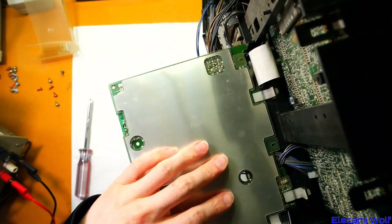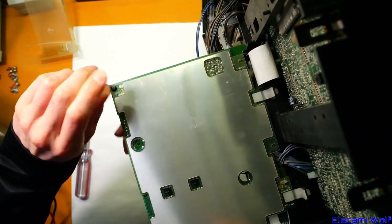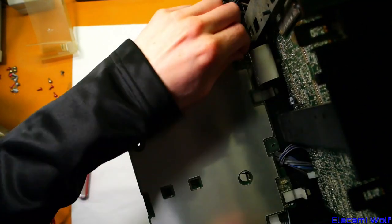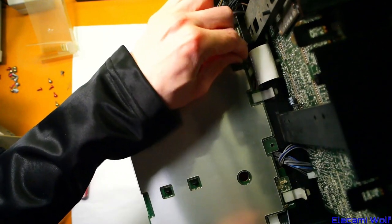Looks like someone's had a go at it — there's a little bit of scratching around that area, like someone's poked it around a bit. I wonder if that's something I did way back around when I first got it, to see — because there's also soldering that's been touched up in this area. Maybe I was looking for dry joints. There are some parts there that run pretty warm, but nothing looks obviously bad. We could probably get the desoldering tool onto that and desolder the whole chip if we need to.